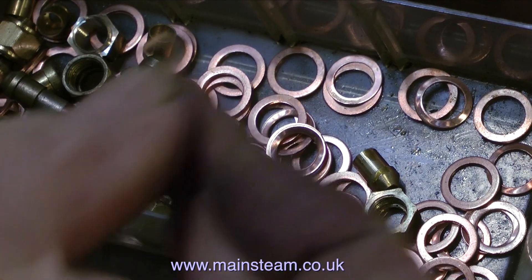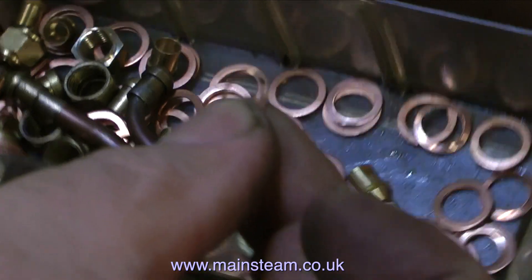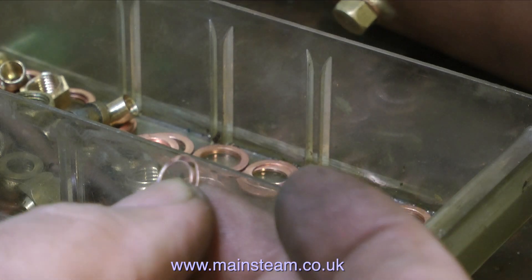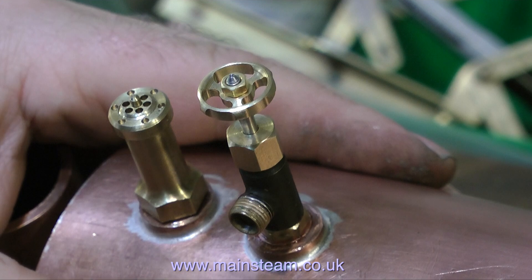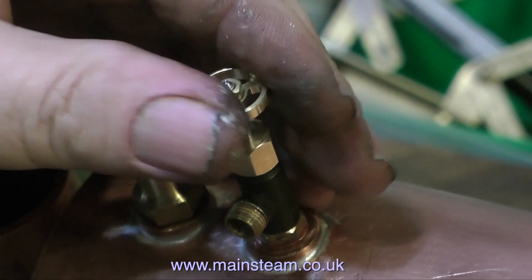The last thing to do for this episode is to fit a washer underneath the tap on top of the boiler so it faces in the correct direction. I'll take this opportunity to show off my box of copper washers, most of which I buy from Black Gates Engineering. I find the right one that allows me, with some Loctite 542 of course, to make sure that the tap is securely fixed and facing in the right direction.